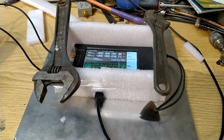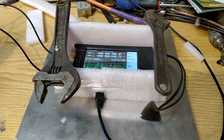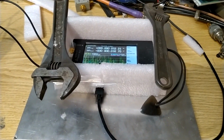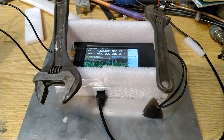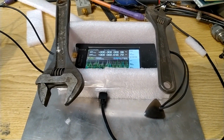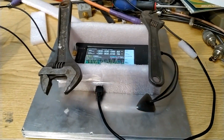And the foam plastic is to reduce air circulation, so the temperature inside of the tiny PFA will be more like the temperature of the aluminium, which should change slowly only, and with a small effect of circulations in the air that change when I come and go to my chair at the side of this table.